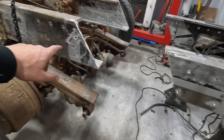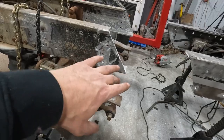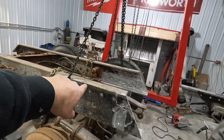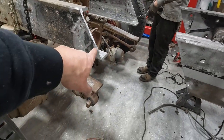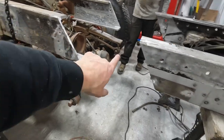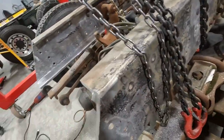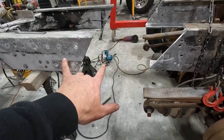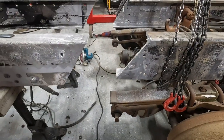Well, with a lot of my back and a little of my brain, we have them two cut. It looks like it's off, but we actually had to chain fall this up to frame up just so I can get the tools in. The clearances are so tight, I couldn't cut it all with a skill saw, so I didn't even bother filming this side because it was a lot of repeat of this side. So now me and Mark, we're just going to mate the two together, see how close they look, back it up again. Then I'm going to clean and bevel this.